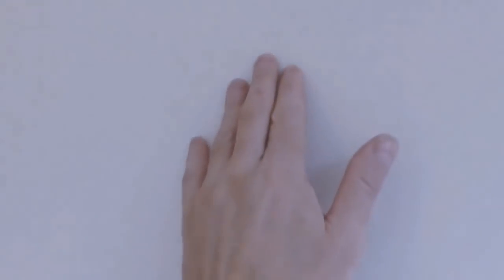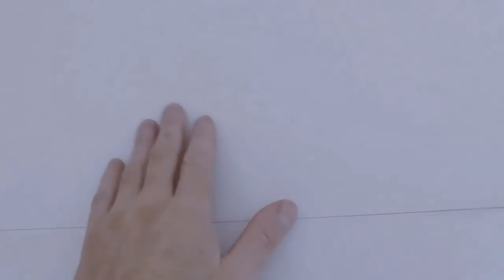Right, so that's two pieces up now. Two to go and the wall's finished. You probably can see the lumps of paste in that. Now don't worry about that, because that's what you want, because as it dries out, it goes smoother. And the top one there, which I did before, that's already started to dry out properly and it's gone really nice and tight and flat. That's what you want. You want plenty of paste on. So that wall's finished now. Looking a lot better.